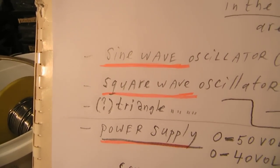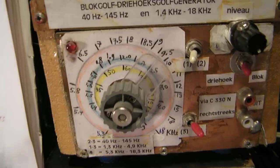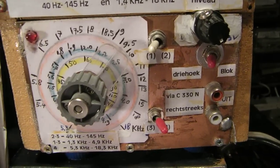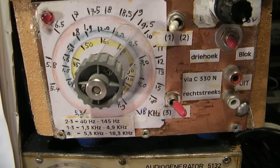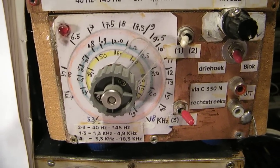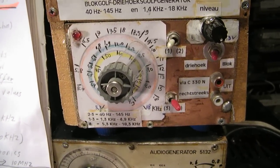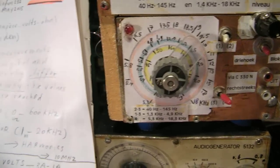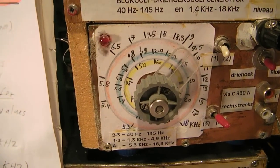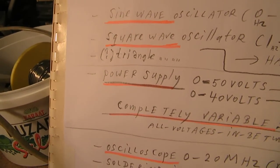You also need a square wave oscillator, and a square wave oscillator is very easy to make. There are a lot of schematics on my channel. Here you see a square wave oscillator that I've made, and it also generates a triangle wave. It works up to 20 kHz approximately. That's quite good, because a square wave has a lot of harmonics. And the reason is, when you use such a square wave oscillator in a radio circuit, you will always find the harmonics on higher frequencies. So the triangle wave oscillator is also here, homebrew. Do you need it? Well, I don't know. Perhaps it's useful.